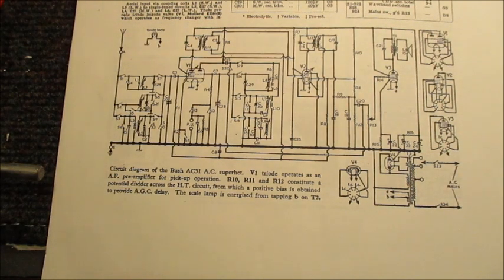To smooth the raw DC directly from V4's cathode, electrolytic reservoir capacitor C23 charges up close to the peak of the AC half cycle and discharges into the load for the rest of that cycle. For the majority of time, therefore, the load current is being largely supplied by the reservoir electrolytic capacitor. However, there is still a ripple effect at that point, which needs further smoothing treatment. This is achieved via a PI filter, or low-pass filter, circuit: C23, R16, and C24.